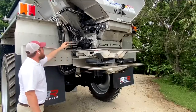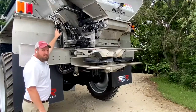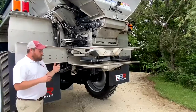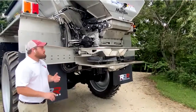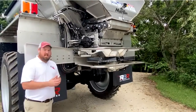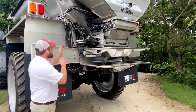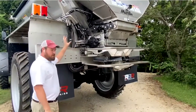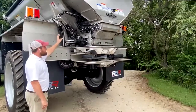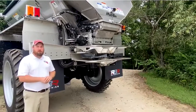We have formed stainless lines on the G5, which is really nice, and if you choose the option you can get stainless steel lines, crimps, fittings, etc. all the way down. We all know the back of this machine is going to get completely caked with debris. Similarly to the front, we don't want to see a lot of high pressure washing back here, primarily because we have a lot of electronic components. Don't aim pressure directly at these components — we prefer volume over pressure and don't want a lot of water getting into these parts.